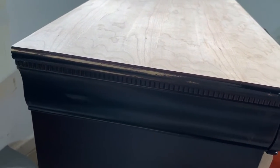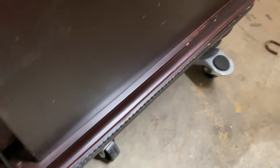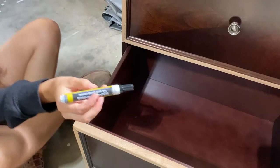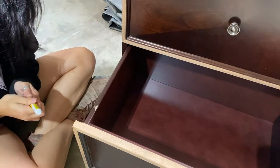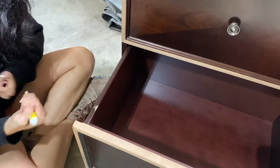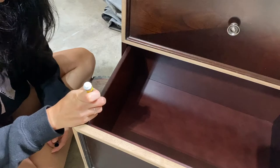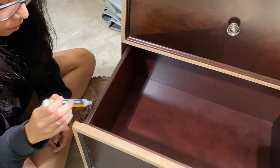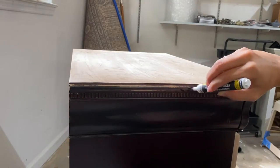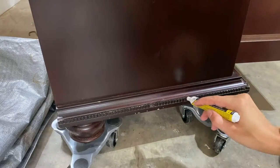For the little bits of damage around the piece, I used a staining pen and it worked really, really well. I went in with a darker stain pen — I'll make sure to link it in the description below — and I just pressed it up against the nicks and spots where there was damage. Those scratches and chips just kind of disappeared. It was almost an exact match. Not quite, but good enough and it covered them up great.